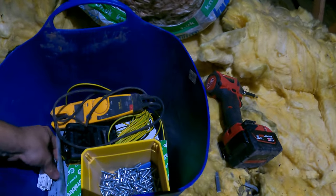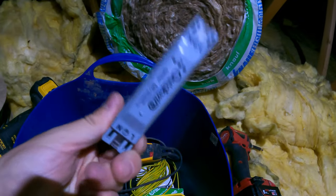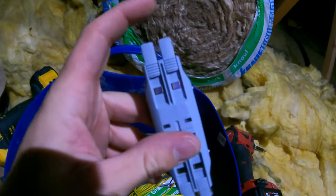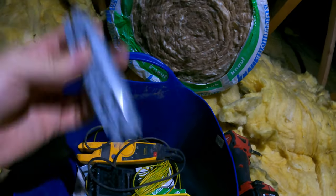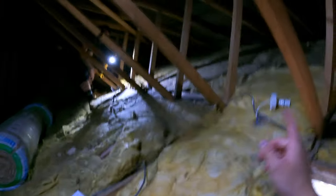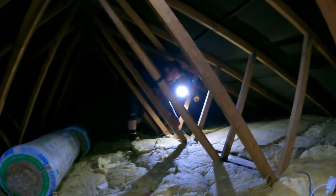We'll use the beautiful quickwire splitter. So obviously we'll find a lighting feed, feed in, feed out when we cut it, and then we've got two spares just to take another feed off. So it's a dead straightforward job. We're going to find a feed, which is probably that one anyway. Take a feed up to the light switch and then up to the switch wire, job done.